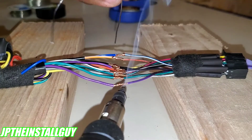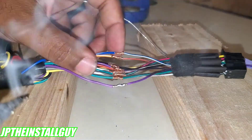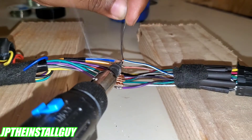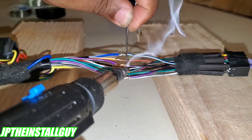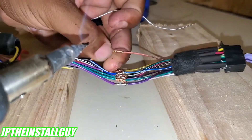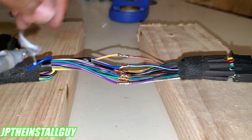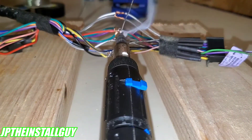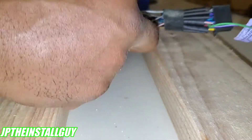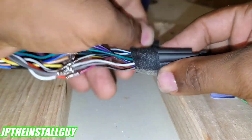While that's heating up, I want to mention one component I didn't cover: flux. Flux is a paste that you put on your wires — either dip the wires in it or brush it on before soldering. It's going to help soak up the solder and help protect against oxidation so your connection doesn't get corroded long term. I don't really use flux all the time, but it is a good thing to use — you don't absolutely need it, but if you have it, it will help protect your connections.